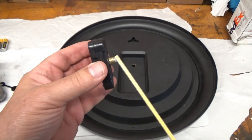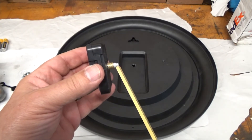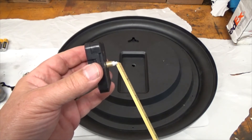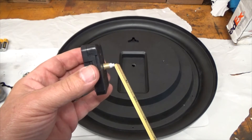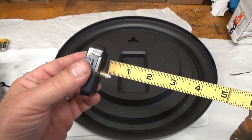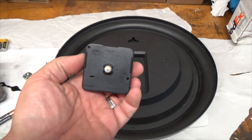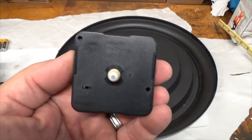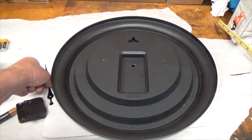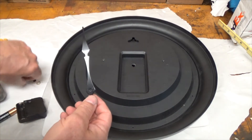The issue is here — you need to know all of these dimensions. You need to know how much thread is coming out, that is very very important, and you may need to know that in millimeters. Then you need to know what this large white section is that holds one hand, and what size the small section is that holds the other hand. You need the overall length, the thread length, and to make sure the hands will fit — and if you want a second hand, make sure there's a place for it to go.